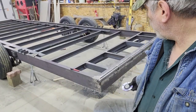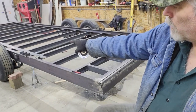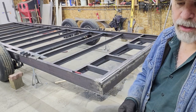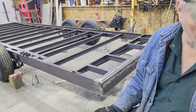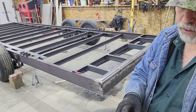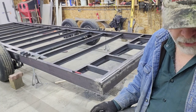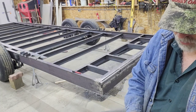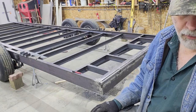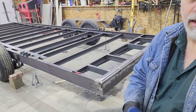But for instance, when I welded those ears on, or a good example would be the stake pockets, when those are welded on, it creates that inside 90 degree corner. When they're brand new, there's a pretty good square edge there, and even after they get worn like this, you can grind them down. But I didn't know about these until a couple months ago on another YouTube channel that I watched. I had no idea they even make them. It's a flap disc specifically for inside corners.